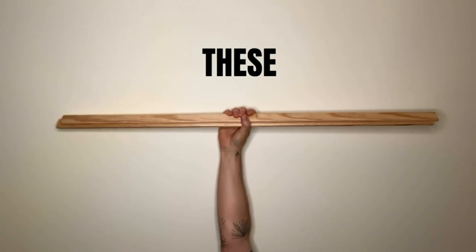All right, the plywood is attached. It's not lining up exactly as I had planned, which is kind of annoying because I was being such a freak about using the level. But that's how this DIY stuff goes, so I gotta work with it. I decided to put some 2-inch pine corner boards on there to make it look really finished. Before I can do that, I'm gonna fill the nail holes that I just made with some wood putty. Then once that's dry, I can sand them down, and then I can install those corner pieces.